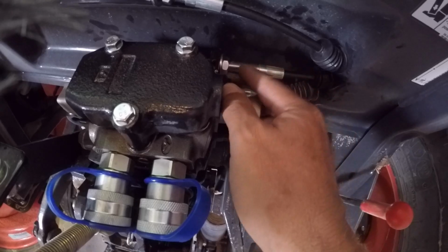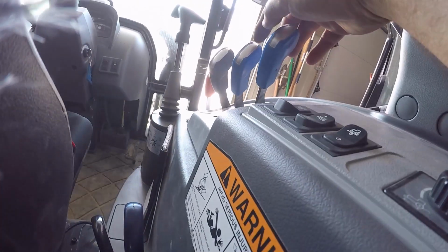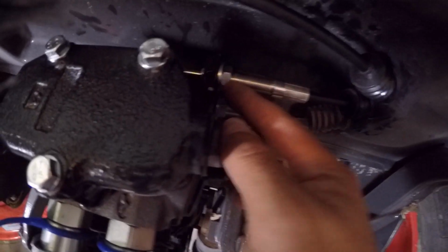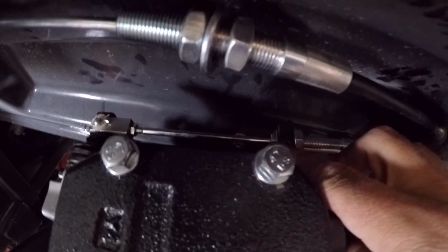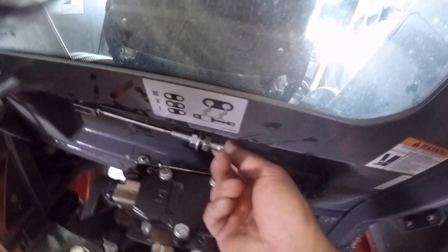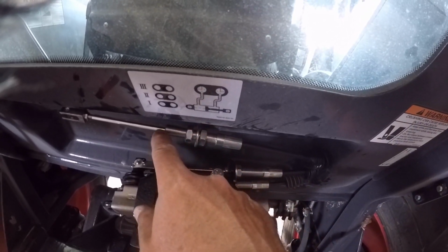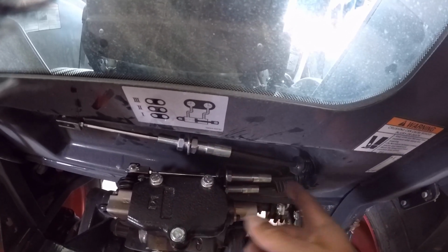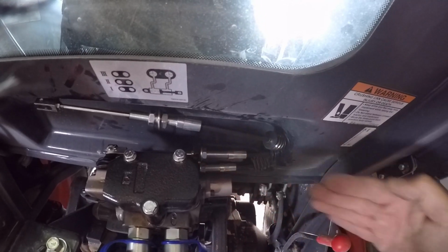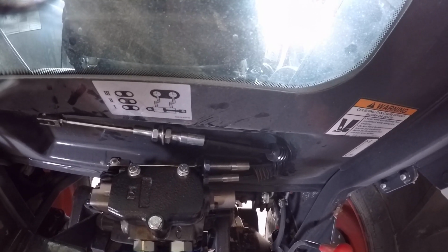So as you shorten this side up, bring this nut back up into this area, that handle will move outwards. So to bring it back in line, you need to tighten this one up. And I'm just about out of threads, but it was able to line up, so I'm going to leave that one. Now when it gets to this one, I might have to actually adjust the inside one so that I don't run out of threads on this one. And you can adjust them to wherever you like the handles. I like mine in a nice row. I could shorten this up and get them to stagger at a diagonal. I'll just play with it once I start using them, and whatever feels comfortable I'll adjust accordingly.